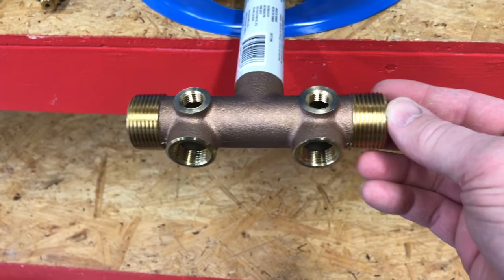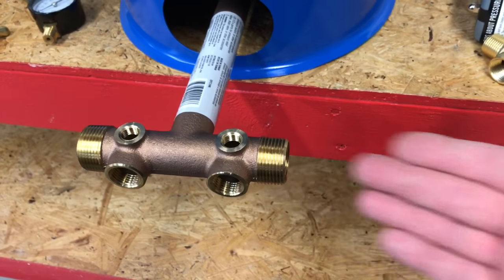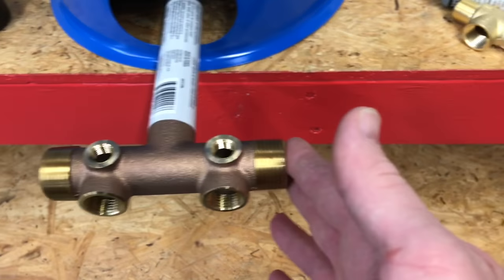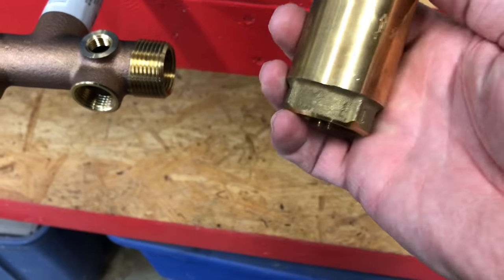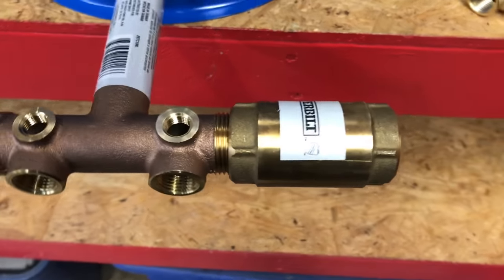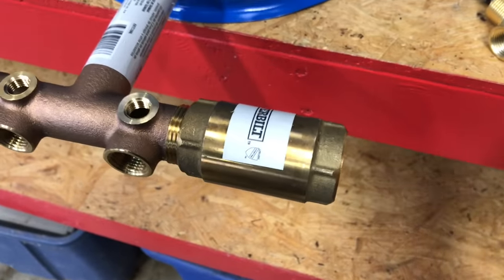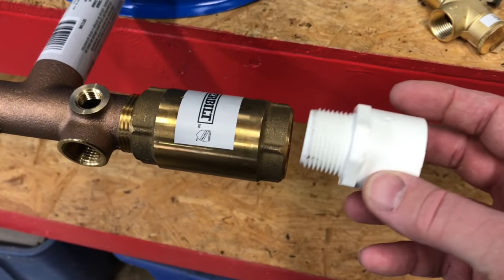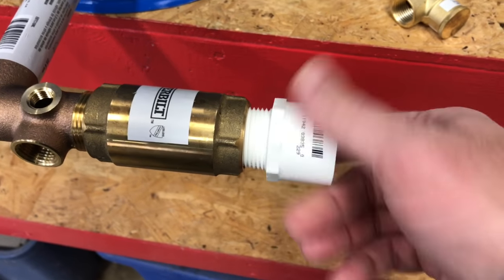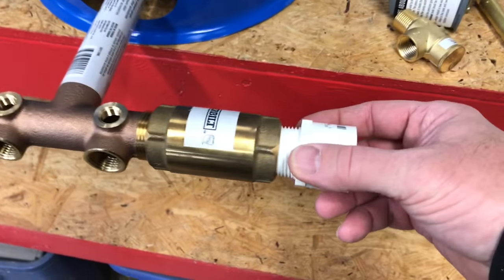Notice here you've got one-inch threads on this side, one-inch threads here, half-inch threads here, and quarter-inch threads here. Our water is going to be coming in from this side from the well pump. If yours is set up where it's coming in the other side, you just do the opposite. The first thing I'm going to have on this side is a one-way valve — it's got an arrow right here pointing this way. So we'll have that valve screwed on there. I'll be putting pipe dope on and tightening everything up before we actually install it. I'm going to plumb in my water line from the pump with PVC, so I've got an adapter that we're going to screw in and then pipe everything in with a series of straight PVC pieces, couplers, and a couple of elbows — whatever we've got to do to get it plumbed in.